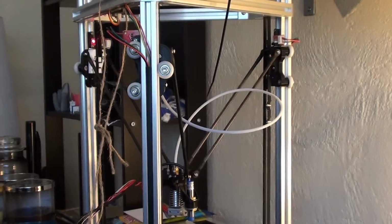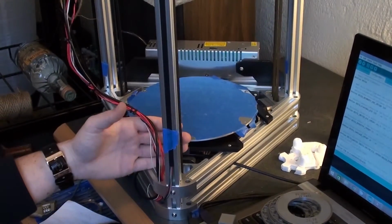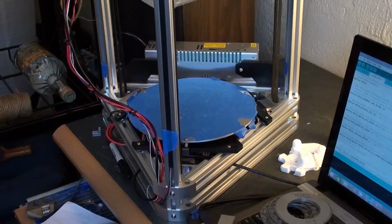So that's a good place to start. Level the bed perpendicular to your supports, the same gaps on the top, and the same distance between the end stops and the top support. Okay, start there. If all that's good and all your other settings are good and you follow the videos, if I missed a spot, let me know. I'll do a filler video.